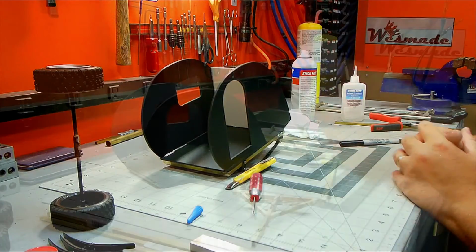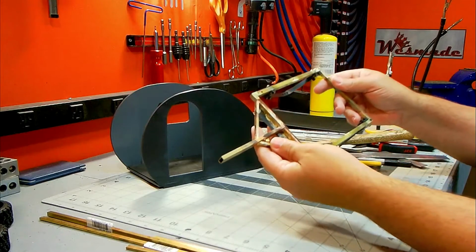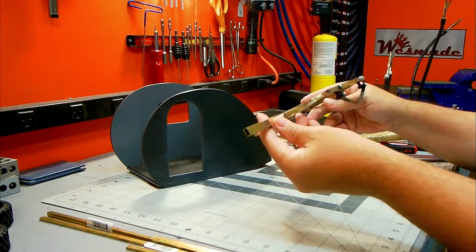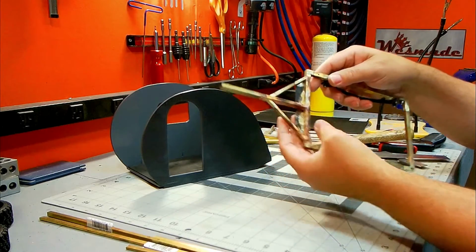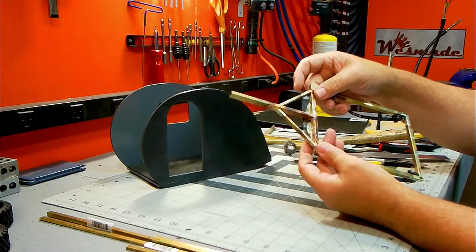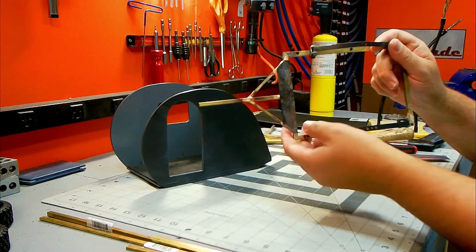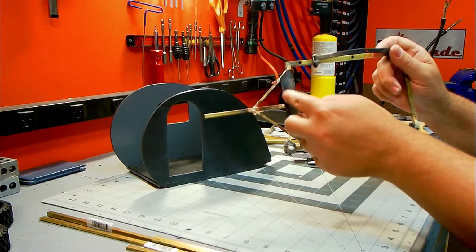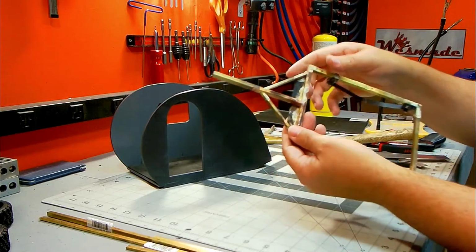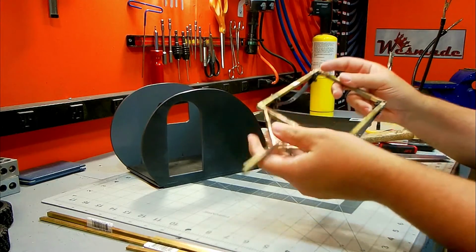Let's get to that. Okay, so where we're at right now is pretty much most of the chassis part, the lower part of the camper, is complete. I've added this tongue area on in the front, some square tubing running out, some square tubing to triangulate on the sides, and then a piece of stainless steel, really thin plate, but it ties all of these joints together and has a fair amount of silver solder holding it all together. So that should be a nice sturdy front mount for this.